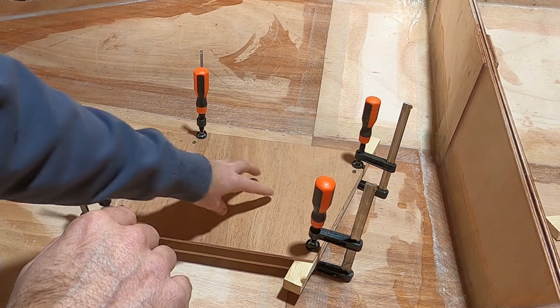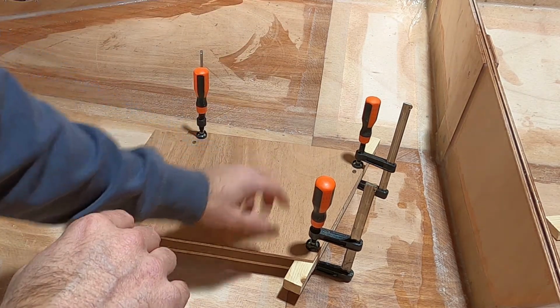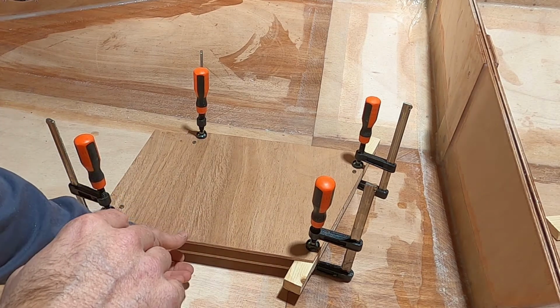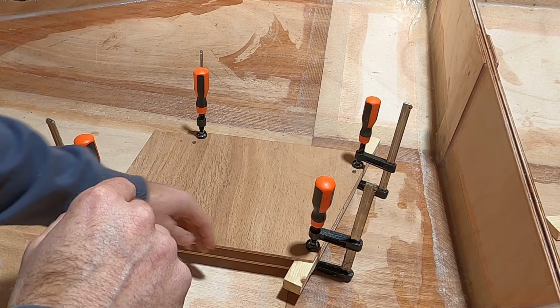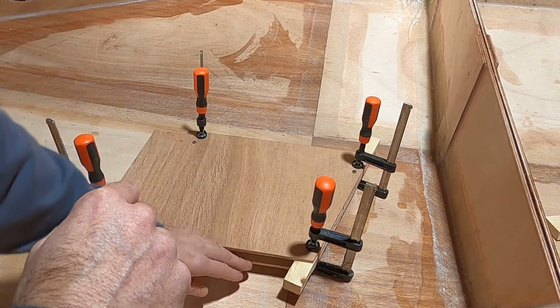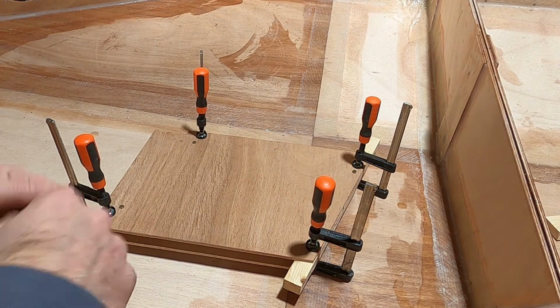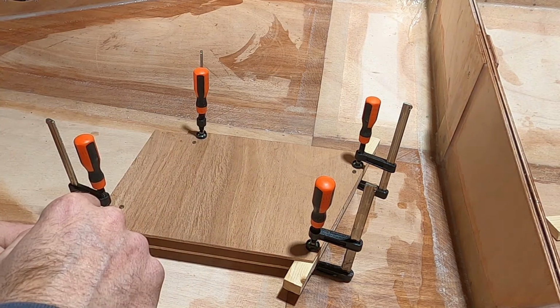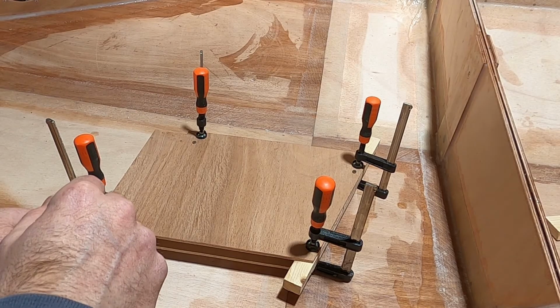Take out the screws and take off this side, and glue it to the posts as well. So I think this is the best way to reduce the twist of both panels, so they will align better, and I think it's easier. So let's unclamp it and put on the first layer of epoxy.